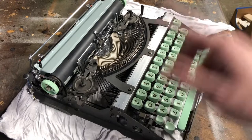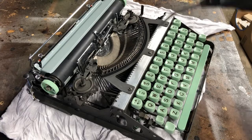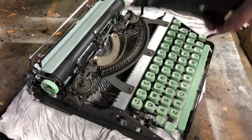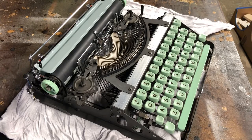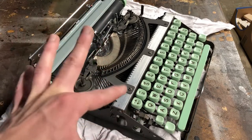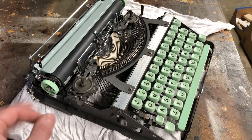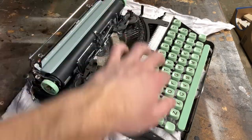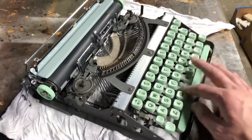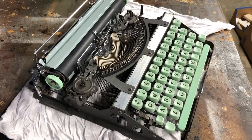Start with a little air compressor blowout — that's always a good first step because if you have really big junk in there it is now gone. I'm pretty confident this machine is fairly clean on the inside, so what I'm going to do is take some mineral spirits and flush out the section. Even though it doesn't really need it, it's just to make sure I'm properly maintaining this machine, but overall it's pretty good to start with, so we're just going to do some very basic stuff.